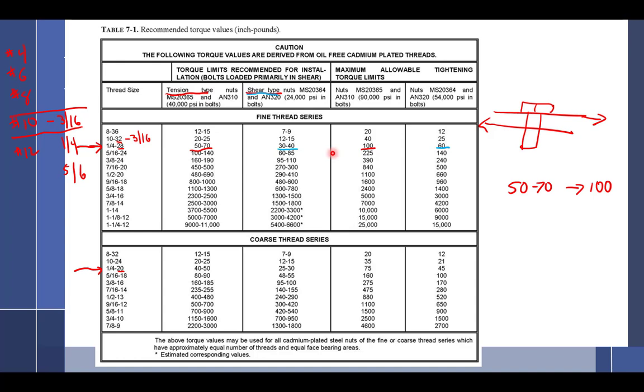That's really what you're doing. And when you do this, especially on critical applications, the point is that you put the bolt under more tension than the component puts on it. So for example, engine cylinders, the cylinder actually bolts to the case, and there's a metal-to-metal contact there. If you're familiar with cars, think of your head and the bolts there. It's different, but same concept. So you torque it to a twist, right? But it's just ridiculous. Nobody cares about that twist.